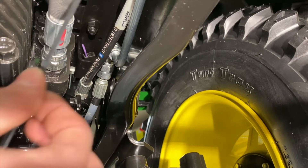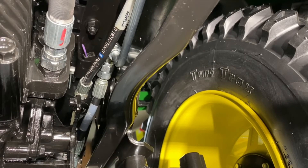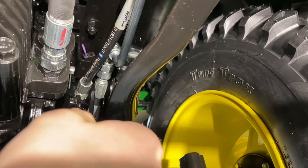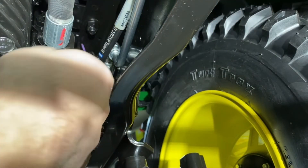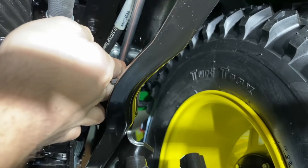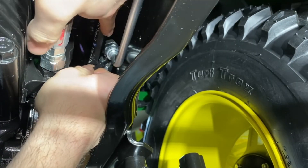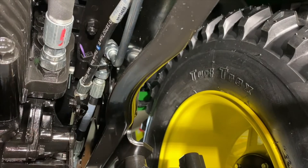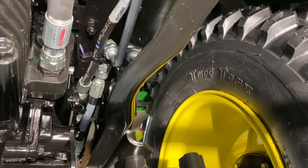The last step: they tell you to install a cable tie or zip tie. They don't supply one with the kit — oddly enough it's not even listed in the parts list. But they have you put one on there around this hose and then around the large 90-degree fitting to keep it from interference with the brake and differential lock levers. I'm going to try to fish one of these through here. Just check one more time to make sure that's supposed to go along that fitting underneath.